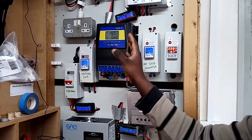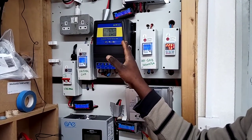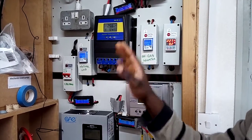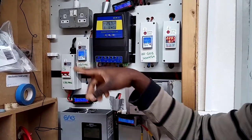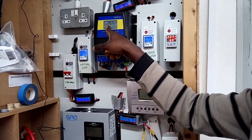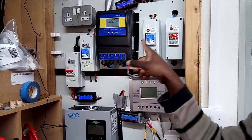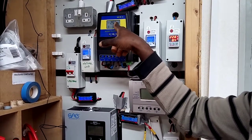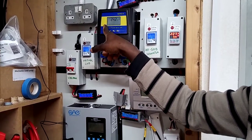It's a really powerful system, however the description on portal websites where they sell it is a little bit dodgy. I just want to let you know before you buy one. It has some buttons — if I click the middle button this is my low voltage cutoff, press it again and it shows my high voltage, which is when it should switch over to inverter mode. Once the voltage reaches 24.2 it switches back to the national grid.